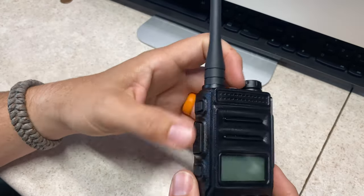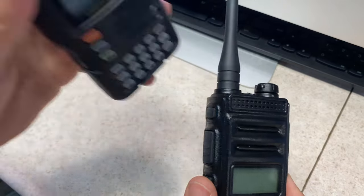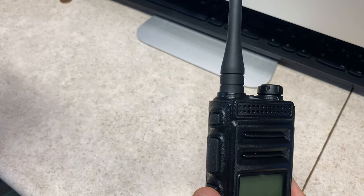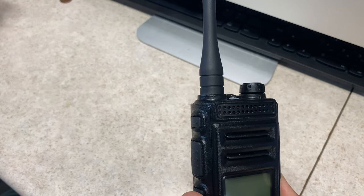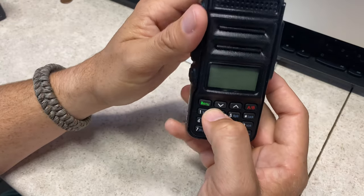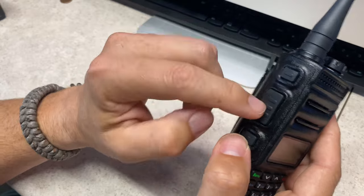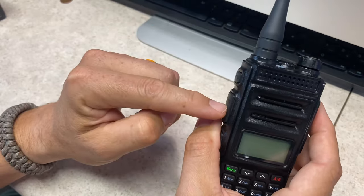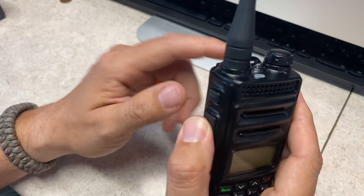As you might expect, pretty good tactile buttons — they're clicky, and I like that. This one over here is some other make and model and it's not clicky. When I'm using that other HT, I have to look and see to make sure I got the button press done. On this, I like the clickiness, and all the buttons are clicky including the side buttons. Obviously there are microswitches under there, but whatever they're using to buffer the contact from the rubber to the microswitch is stout enough that it feels like a solid click.